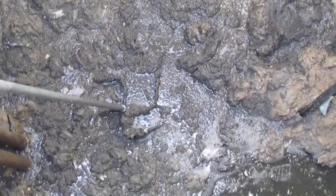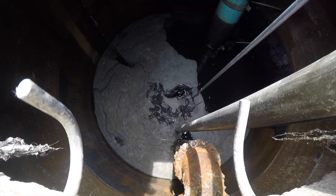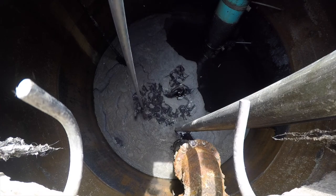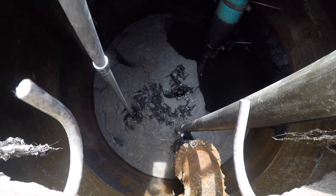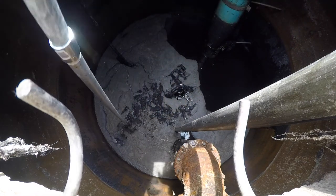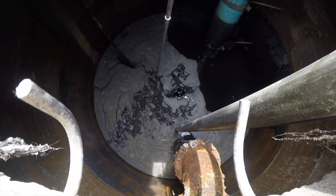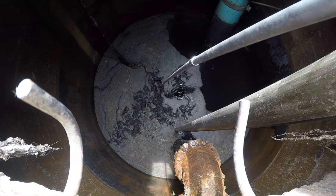By slicing a thick cap into a number of cuts, the agitation action of the wizard from below the cap will segment the cap and begin to form rolling fatbergs that will quickly dissolve. If this cutting action is not performed for thick grease caps, it might take several days to completely get rid of the cap with only the wizard agitation.